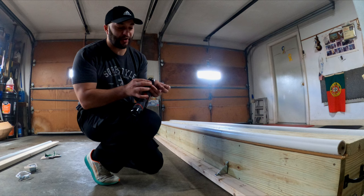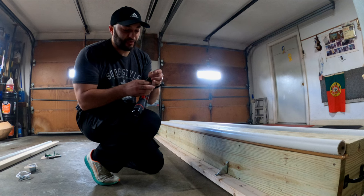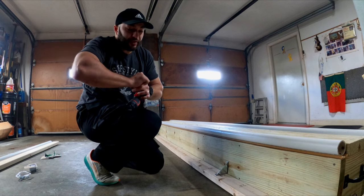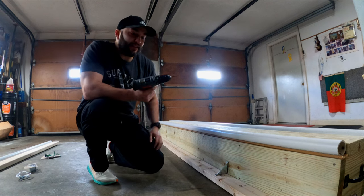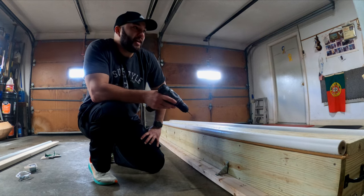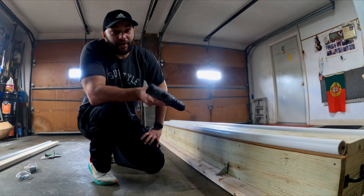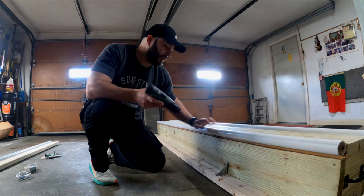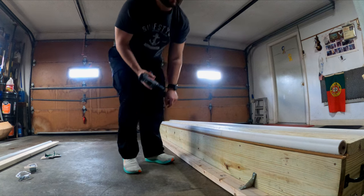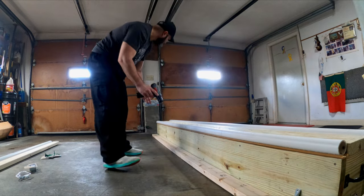This next step isn't completely necessary, but I like to do it because it makes things so much easier. I bought a cheap drill from Walmart for about $20. Putting a drill bit in first and making a pilot hole where you're going to drive the screw makes it a lot easier to get the screw into the wood. When I first built this, I went screw directly into the wood with no hole and it caused my super weak drill to hang up. If you've got a powerful drill, don't worry about it. You can use a wall to line up the braces at a perfect 90-degree angle.